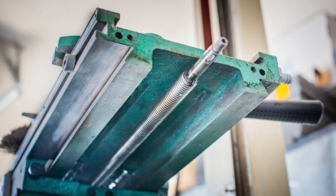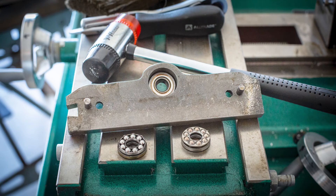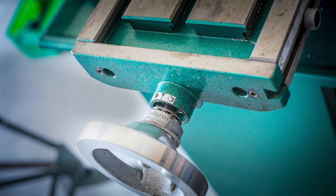Here's a clear view under the table now that the lead screw bracket has been removed. Here's a shot of the indexing pins in the lead screw bracket along with the inner and outer thrust bearings, and now I just repeat the same procedure for the other end of the table.